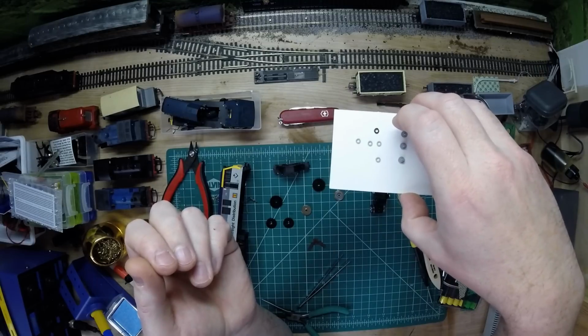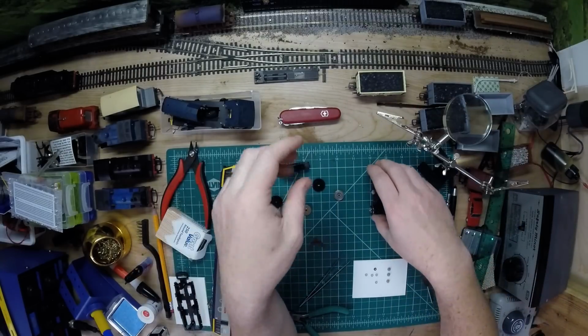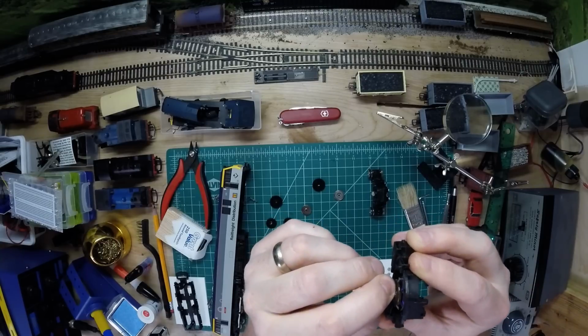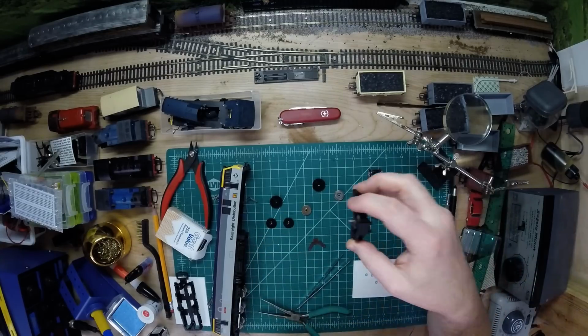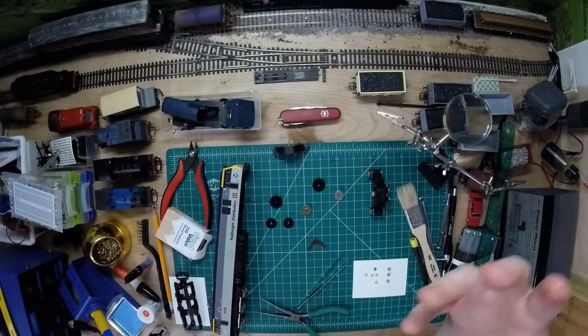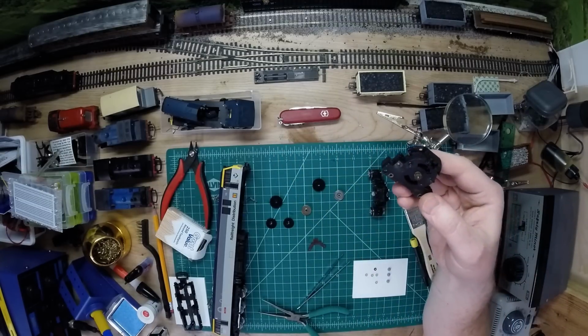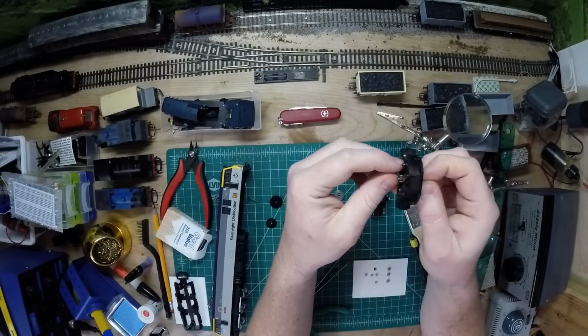slightly increased in size and it was loose. And so it was basically causing the commutator to move back and forth. And when the commutator was moving back and forth, it wasn't making full contact with the brushes, so it made that horrible brush noise. So if you've got a slightly newer Ringfield motor, sometimes these pop off and then, you know, that's the problem.